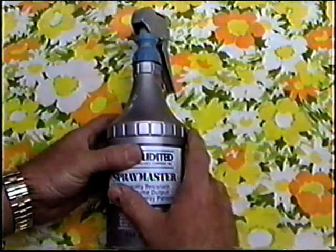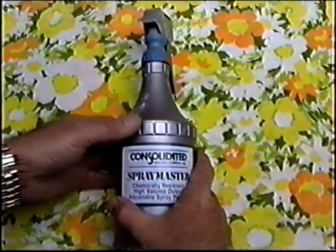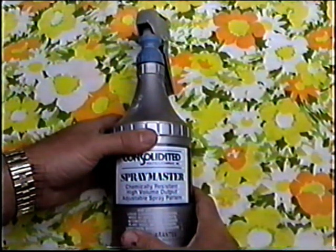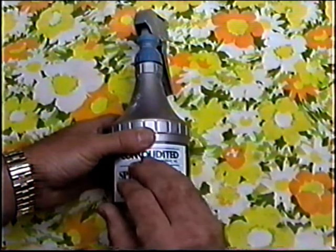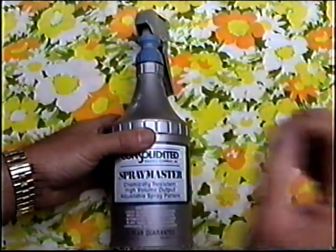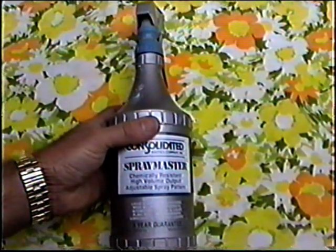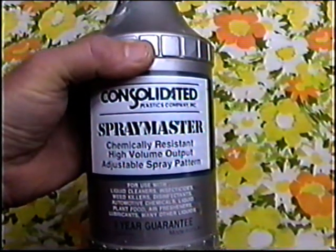If you're not willing to do it, if you skip off and run off to do something else when you should be sanding out another coat of silver or two, the finish will be nice. Sanding this out will make it better no matter what you do, but sanding it out more than once or twice will make it perfect. And this is the step that seems to win the concours award every year, in my estimation. This is what separates the planes in the front couple of rows.